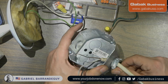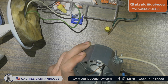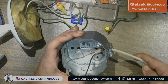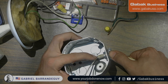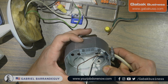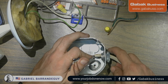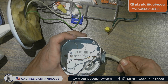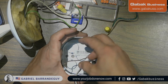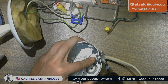As you can see here, we have the connector. Once you have the connector here — hopefully you have this already, but if you're installing for the first time I'm going to show you. This is where you put the cable, and then you secure it, because if you remove these knockouts and put the cable without securing it, the sharpness of the metal will cut the wire. Also, if someone is pulling the wire, it's going to be dangerous because you're going to have the live and the neutral here and things can get disconnected.